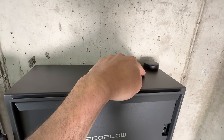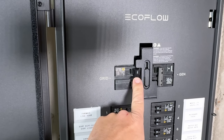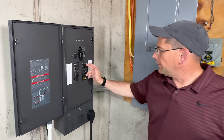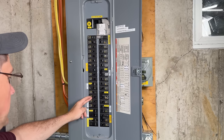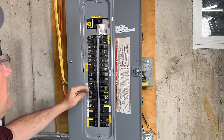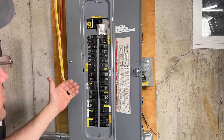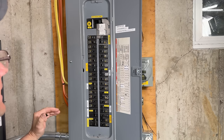Up here on top is the Wi-Fi antenna. Coming right down here we have our interlock switch. This is the 100-amp circuit coming into the transfer panel from the main breaker panel, the 50-amp supply from the generator, and here are my circuits for the house. EcoFlow provides a total of 12 spaces in this box, and I ended up using tandem breakers. I had a 40-space box in this house and ran every individual thing on its own circuit — even the smoke alarms are on their own circuit, each bedroom on its own circuit, lights on their own circuit.